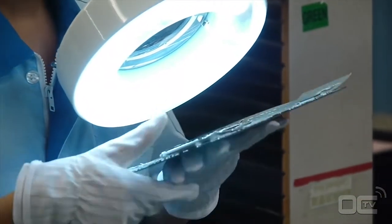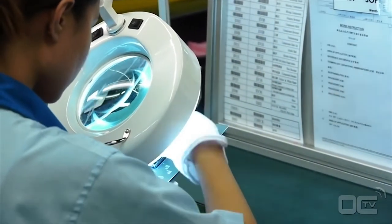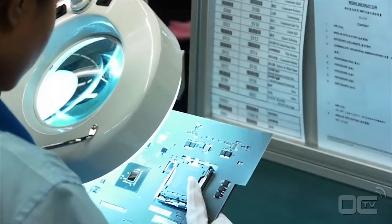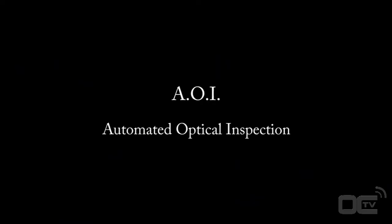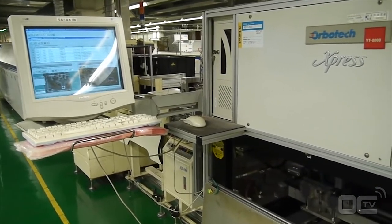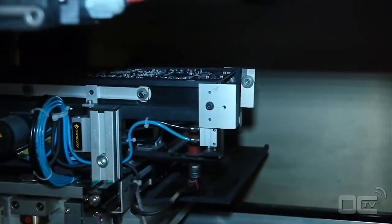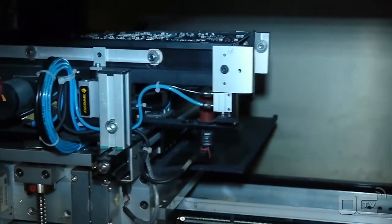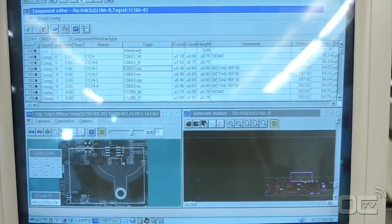Your motherboard now has all the small resistors as well as the chips and the socket — it's time for the visual inspection. This inspection avoids any misplacements or missing parts. Components smaller than 2mm can't be checked by visual inspection, which is why we have the AOI machine. The automated optical inspection machine checks if there are any missing or misplaced components and also checks all the components that have visible soldering points, like the audio chip.